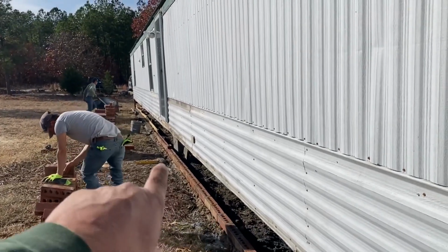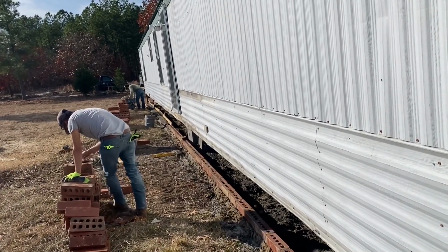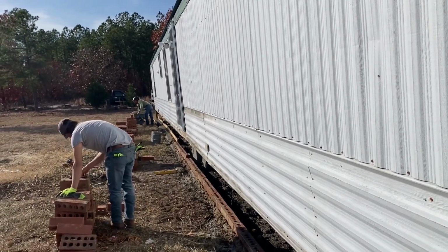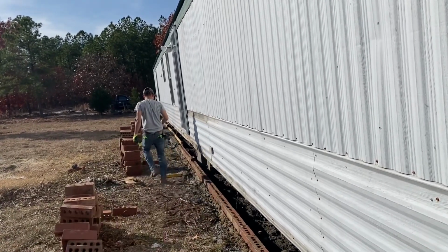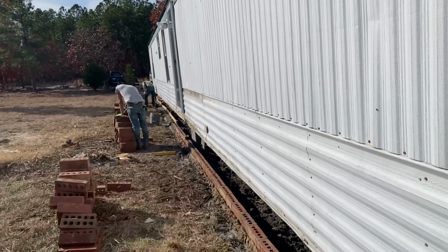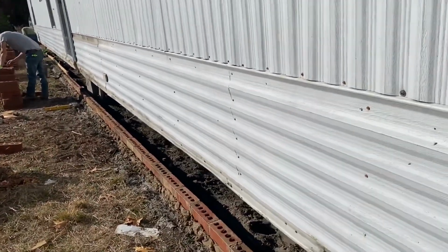A pro tip there in the middle, they take a piece of cardboard off of one of the concrete bags and they fold it over and put another brick sitting on top of it. So that holds your string line from going down or up and keeps the vibration in the string line to a minimum. So whatever he does on that side of the line, it don't affect this side of the line, and it keeps it on a straight plane. So anyway, we're getting to it here.